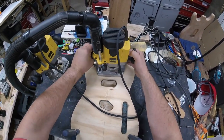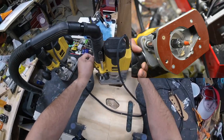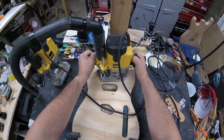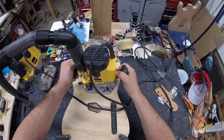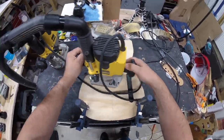So then we're going to do our fine tuning. I've got a CMT orange three-quarter bit in my other DEWALT 621 router, and I get all the depth stops set right. I'll route out any of the remaining waste from the earlier router pass.